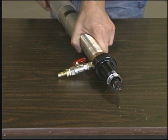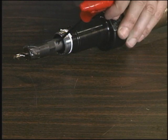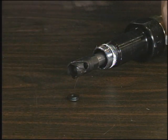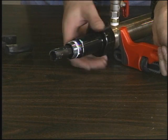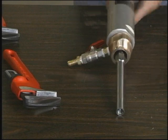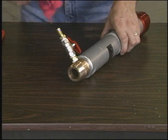To remove the coupon from the cutter, turn the sleeve clockwise until the cutter is exposed. Remove the pilot drill in order to make the coupon removal easier. When you are finished, remove the accessories from the tool. Turn the sleeve clockwise until the threads of the feed screw are hidden and the tool is fully collapsed, then remove the shaft extension. Wipe off and store all components.